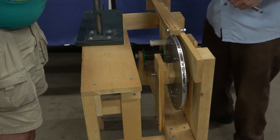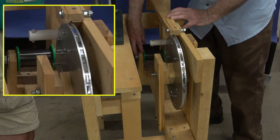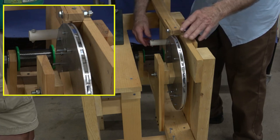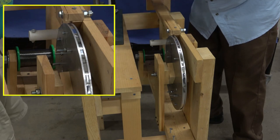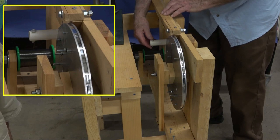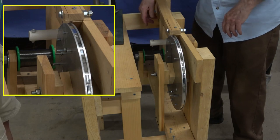But normally the spool of wire that you're going to draw the wire from would come from here. It would run through a tensioner that maintains some tension on the wire as you pull it, and also won't let it back up, because you don't want to loosen the spool of wire, because wire goes every which way. You've got to keep control of the wire at all times. So this is a tensioner and an anti-backup to keep it from spiraling off the drum.